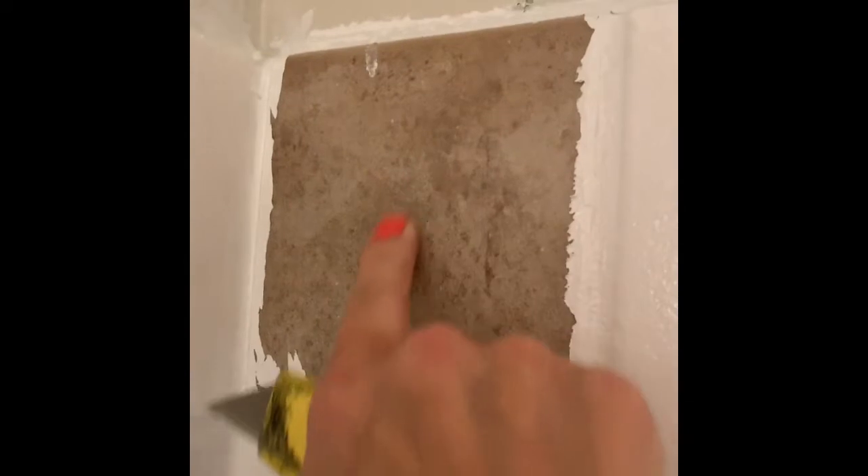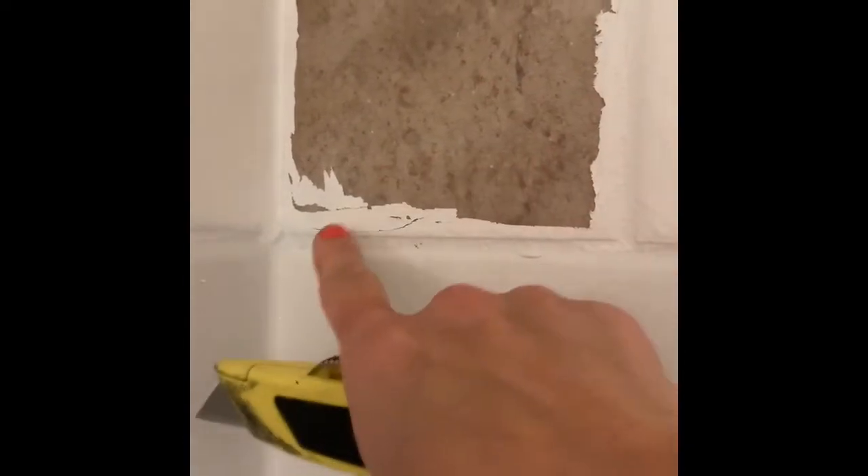Well, this isn't a good sign. There was some drip of paint — I went to wipe it off, peeled it off, and the primer and everything came off. Now I'm cutting it with a razor blade to make a straight line, and I'm going to peel. All this peeled off when I peeled off the latex paint — it pulled off the primer and everything. So now I'm sanding it with a 90-grit sandpaper and I'm going to try to cut this and make it as straight as possible, put another primer on. Still going to try the latex — hopefully it works.